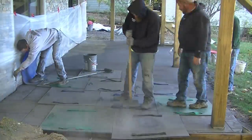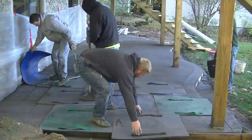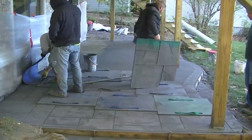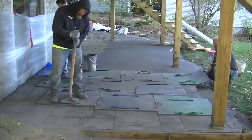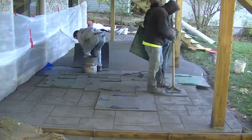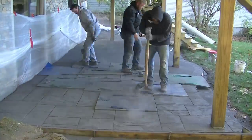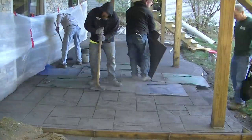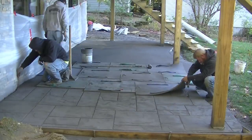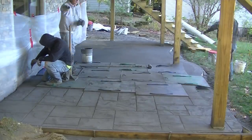This actually dried really well for us today. It was a little chilly out, and the concrete company had about 100-degree water — basically warm water for concrete — so the concrete was a little warm today. That helped it set up a bit, which made the whole process easier. As you can see, we've got sweatshirts on. We're on a lake too, so that made it a little bit colder.